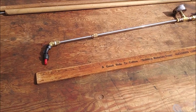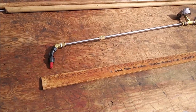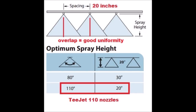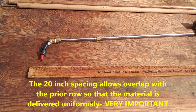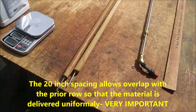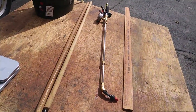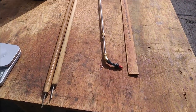If you look at the specifications for these T-Jet nozzles, they're specified to operate vertically — basically straight down — from a height of 20 inches and with 20-inch spacings. To accomplish that, I made up two broomsticks. If I hold one out at the end of a row at a 45-degree angle and stick it in the ground, that'll be my marker for where I want to be in the center of the next row coming back.